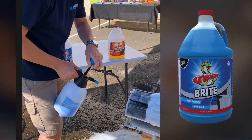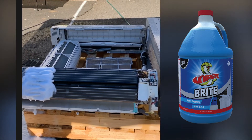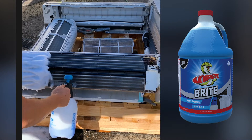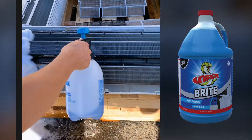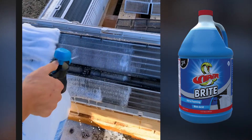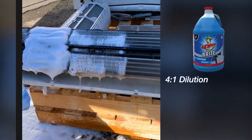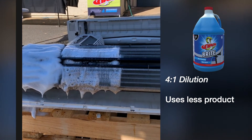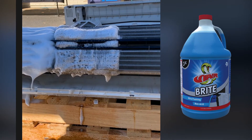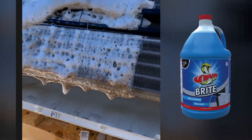Now, Viper Bright. You can see I've wet part of the coil and the other side is dry, so I'm going to apply to both so you can see the difference between a wet coil and a dry coil. See that chemical reaction starting to happen now. At a 4:1 dilution, I've probably only used about 30 ml of product. See how the alkaline is starting to react with the coil — getting into the coil, blistering and lifting internal contaminant that's embedded in the coil, which to the normal technician's eye can't be seen from the surface.